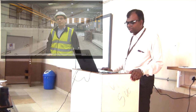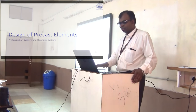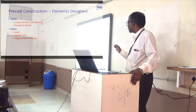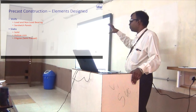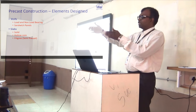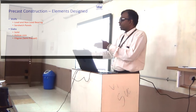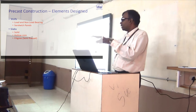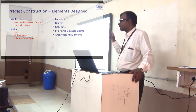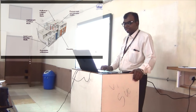These are the elements which we typically precast: walls and slabs. Filigree is the semi-precast system — you have a cast-in-situ topping applied over individual precast elements, giving continuity and making them behave like a single element — forming a membrane. This is the filigree slab. Then you have facades, beams, and columns. These are the standard forms of precast units: rectangular beam, L beam, inverted T, and the AASHTO bridge beam whose form has been standardized in AASHTO.